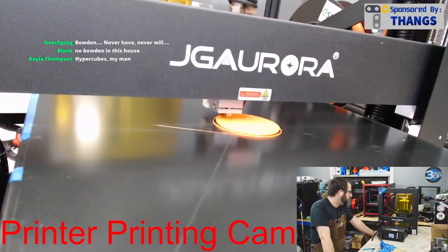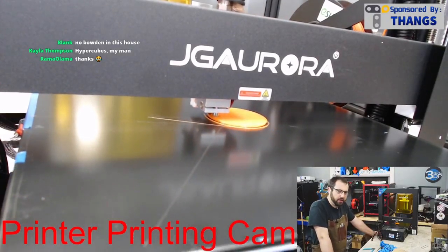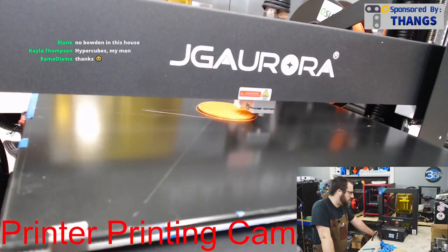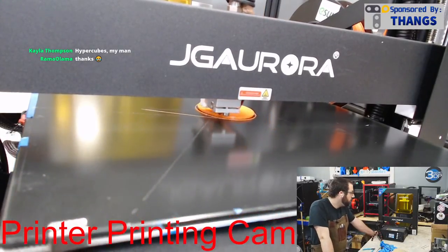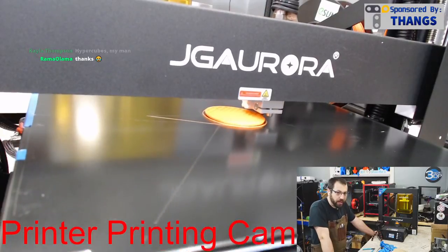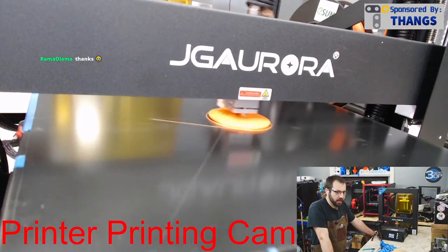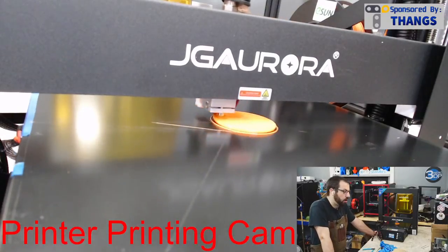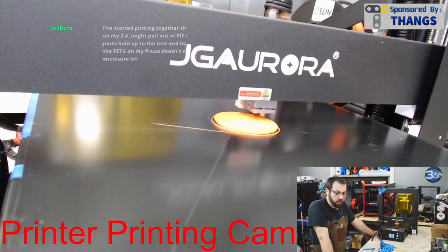But the days of having to lighten your hot end, I think, the tool head, because you want to print fast, are nearing their end because printers are built better than they used to be. They're more rigid. And firmwares have evolved to compensate for a lot of the issues. We have pressure advance tuning. We have, well, really good pressure advance tuning. We have input shaper tuning.